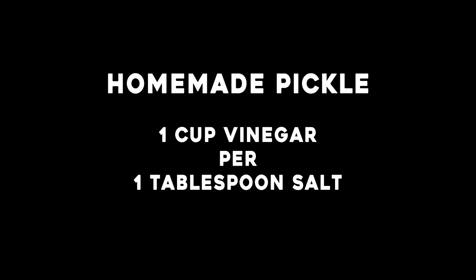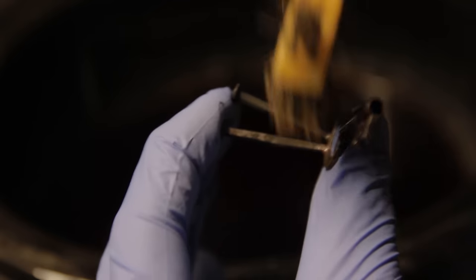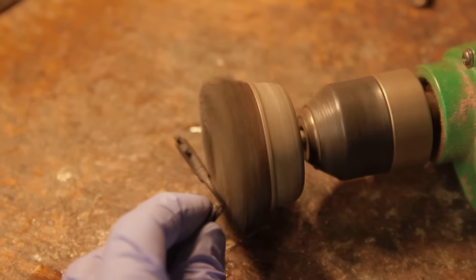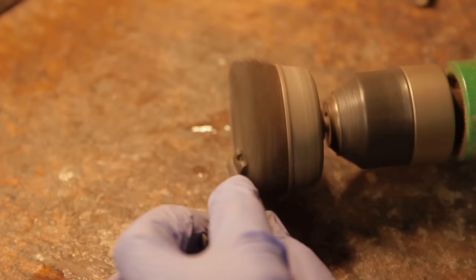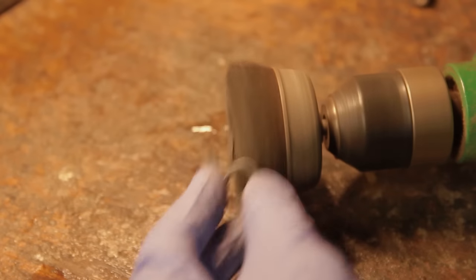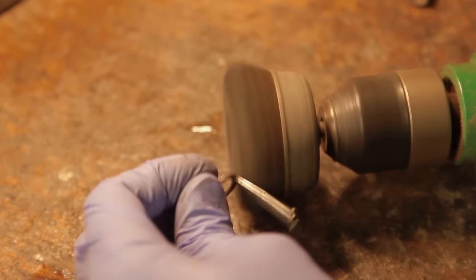A simple pickle recipe: it's just one cup of vinegar per one tablespoon of salt. Once you remove it from the pickle, the rusty crusty stuff should remove pretty easily. You can hit it with a wire brush. I also like to take some sandpaper if I want to get it a little shinier, or you can hit it with a wire brush on the drill — that's probably one of my favorite techniques. You can buff it as shiny as you would like. The Craftsman likes to leave a little bit of patina, a little rust and some age in his pieces — I don't really like to make them too very shiny.